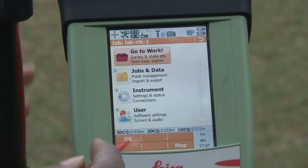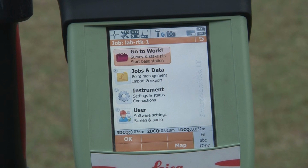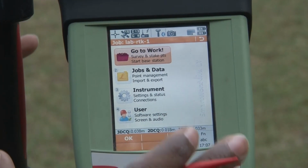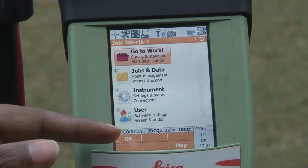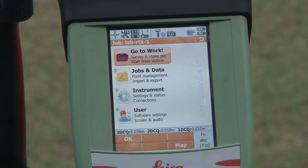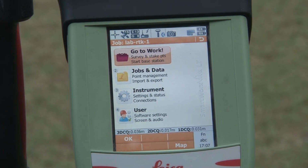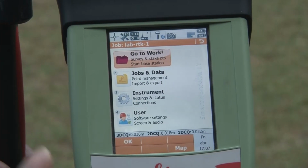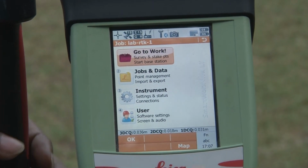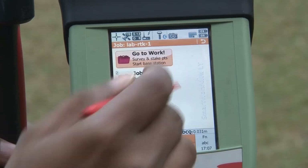Now in this case we can say that the RTK has been initialized, and your system or your setup is ready to collect the data. With this accuracy level you can acquire the elevation data from your respective areas or your research areas. So now we will acquire some data, or we will show you how, using these options, you can do your survey.